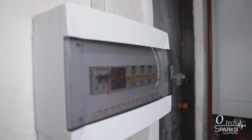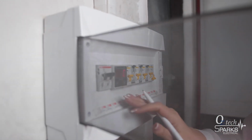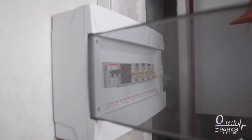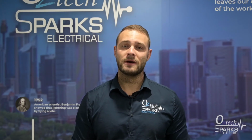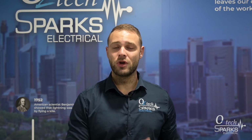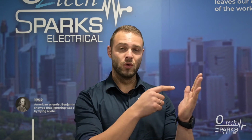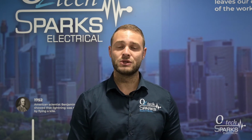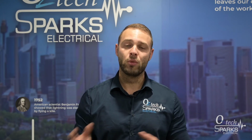The one thing you want to avoid as being the occupier of the property or being the electrician going to the property to do some work is going to the switchboard, flicking off a circuit and finding that it's the wrong circuit that's being flicked off for the work that needs to be done. When you're doing work on a commercial property, let's say if it was an office fit out, if you're going to be adding extra power points on an existing circuit, you'd go back to the switchboard, open up the switchboard and grab the switchboard schedule. You'd see the circuit that you've tapped into, and you'd also write down after that what extra power points had been added on that circuit. So there's always a clear idea of if a circuit had been switched off, what points had been switched off with it.